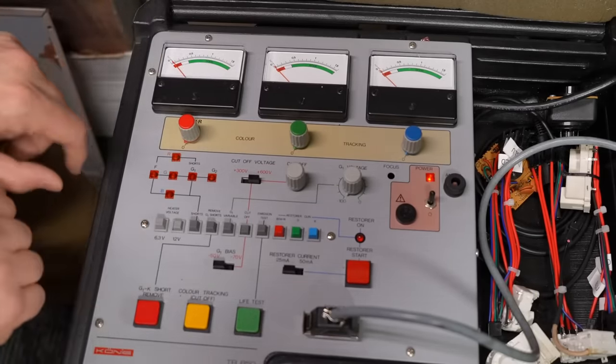I think what we've determined is that the CRT on this thing is actually in pretty good shape — not super worn out — and we should get a decent image. For the next thing, I'm going to install an RCA jack into the back of this monitor. There was a blank plate right there and I just took the screw off. Interestingly, underneath the blank was what appears to have been two extra connectors on the back with another switch for external sync in and out. Either way, I can put the RCA jack in there. RCA jack is installed and I rewired the connector so only the RCA jack is in play now, though the 75-ohm enable/disable switch is still working.